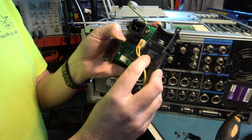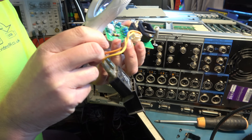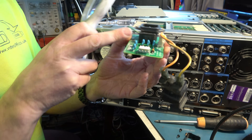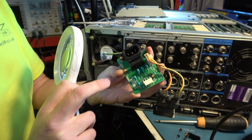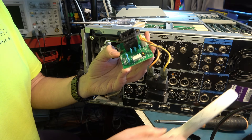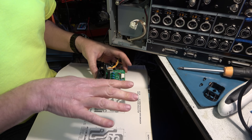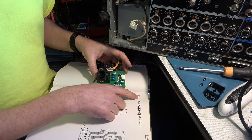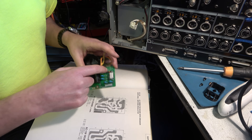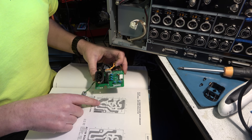The breaker is rated at 250 volts. The filter capacitor is rated at 275 volts AC. Everything here appears to be rated at 250 volts at least. So let's just see if that's the same part number as the one installed in the PAL machine. It says AC-155. Looking at the diagram for the PAL machine, it says the AC connector board with breaker is AC-139. But here our board is AC-155 and does appear to have different connectors on it and a different layout.